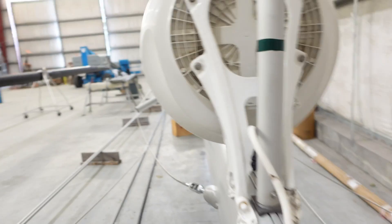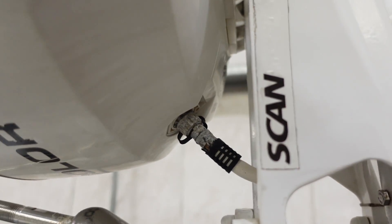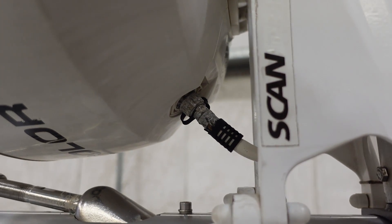We don't have to rely on blowing a horn ourselves. I'm going to be running the wires up for the foghorn today. One more thing — the radar cable itself. Up here, there is a lot of corrosion and stuff on that cable. I don't want the radar to crap out on us at some point, so I have ordered a new cable and we're going to put that through the mast today as well.